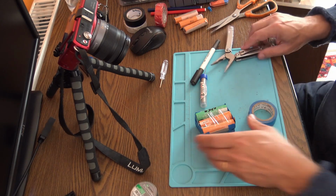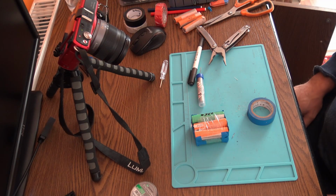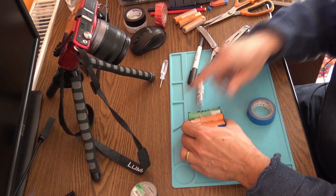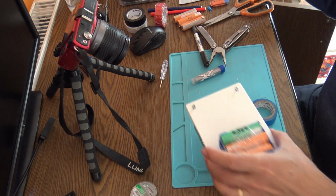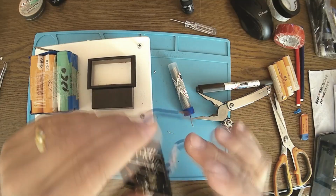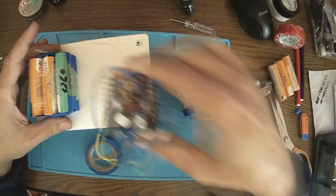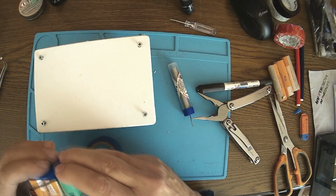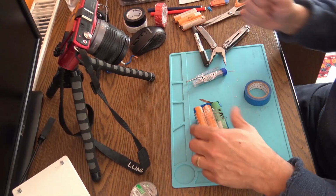So we have like 3 amps at 12 volts. That means like 36 watts or something for emergency situation. I was hoping for better, but this one will stay in here. I'm gonna have the ammeter right there, like this, and a boost converter and a buck converter for having different voltages. Okay, so this was the part 1.